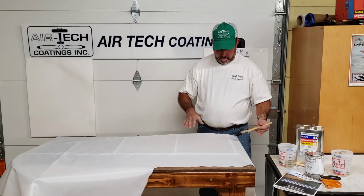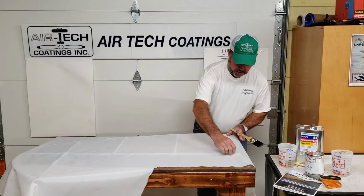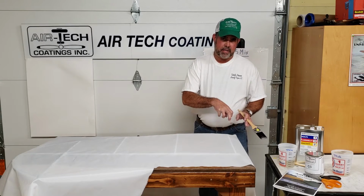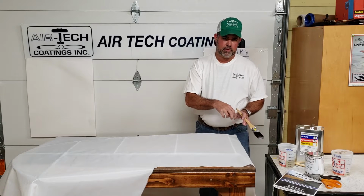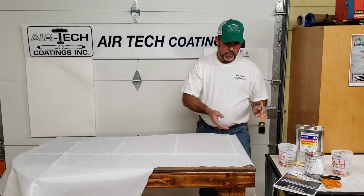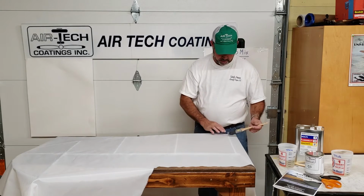And I see sometimes people will just take a rag and the RA4000 and they'll wet it through. And yes, that does activate a little bit, but if you think about it, just because it's wetted with reducer, there's no glue that followed that. You want the thin glue to take some glue with that reducer down to grab the other part.